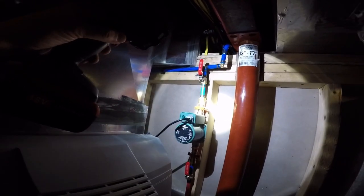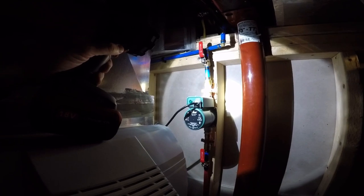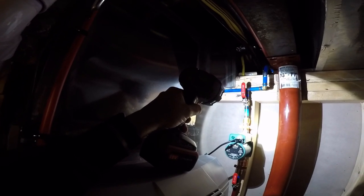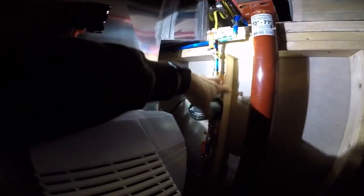The hum here — the low drone — I think is because I screwed it right to the studs. It's probably transferring some vibration to the frame, so maybe I need to put some rubber isolation pads behind that mount or do something different there. But it's more the circulator noise that I'm worried about. That noise — I don't know if that's normal. It sounds like there's air in there, but there can't be. The only other thing I could try is to crack these four bolts and pop the cover off and see.